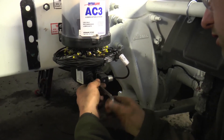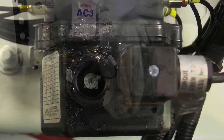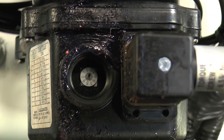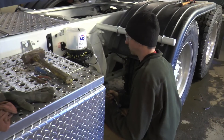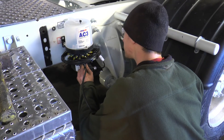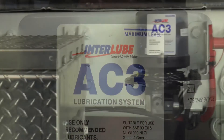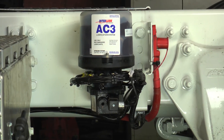One of the features of the Interlube system is the adjustable timer setting on the pump. If adjustment is needed, this is how it's accessed. The pump is filled through the grease zerk fitting located at the lower left side of the pump manifold. Be sure to take note of the maximum and minimum fill lines, and be careful not to overfill the reservoir.